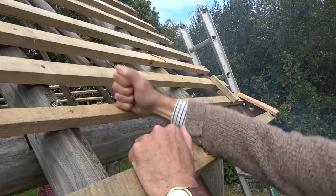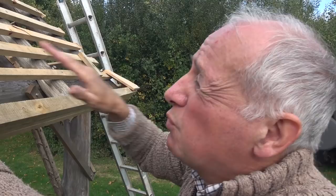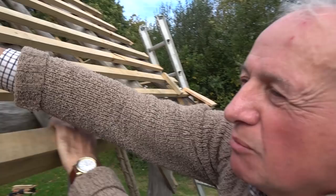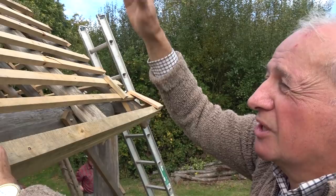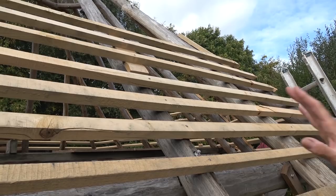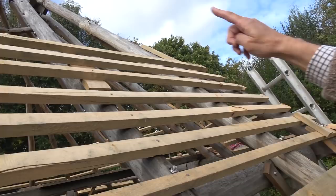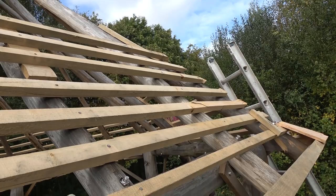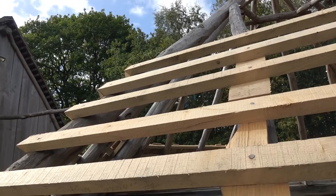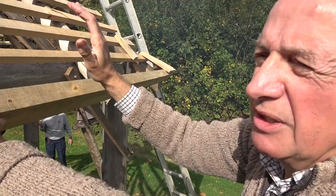Particularly when you're nailing in, you don't get so much vibration — even in the middle, if you had a three-quarter batten you'd get too much bounce. The other important thing is when laying the roof, it's far better that the rafters dip because you can pack up. If they dome or curve out you have a problem, because you've got a high point and the battens will flex to take the shape of the roof. It won't be absolutely straight — it will undulate somewhat. But it's important that the main rafters on the six sides curve out while these subsidiary rafters curve in, so you're filling the gaps to the low points, otherwise you'd have to cut battens which weakens the structure.